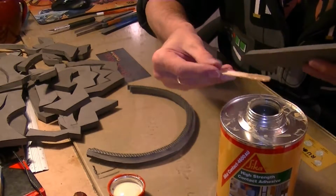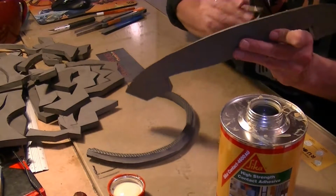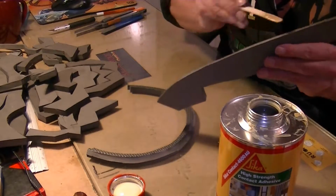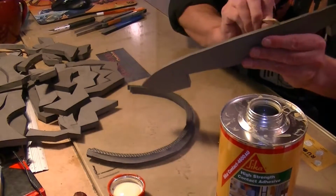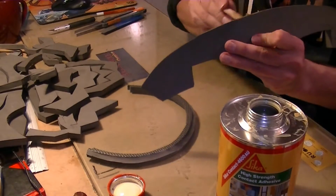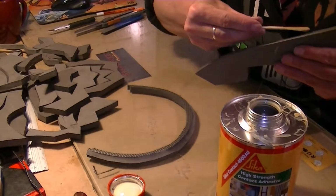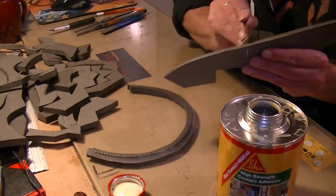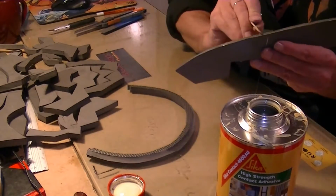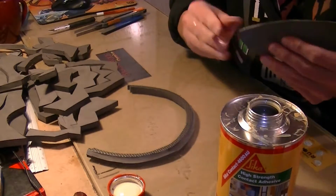I have found, particularly when the joint is under stress and there is a lot of glue sitting on the surface, pools of it, it doesn't dry, and once you put the two pieces under pressure while shaping them, it lets go, it peels apart. Not the entire joint, but the outer lip, the pristine smooth surface, smooth joint that you're after. Doesn't necessarily happen, so don't have excessive amounts of glue on the surface, don't let it pool up.